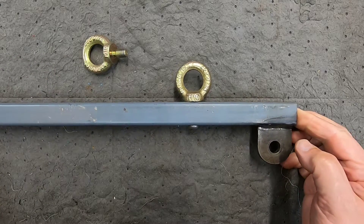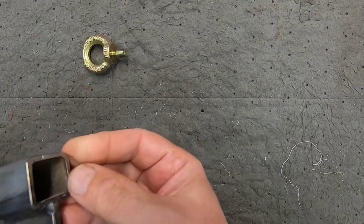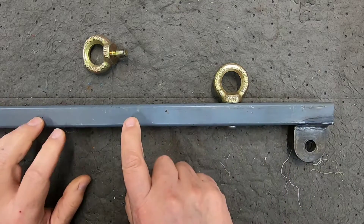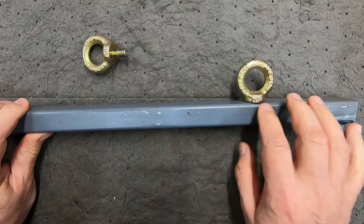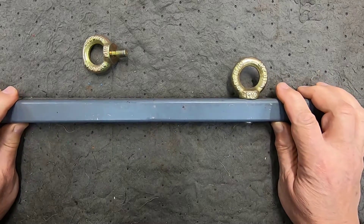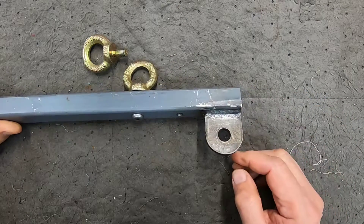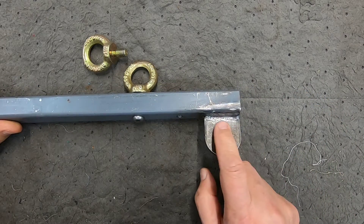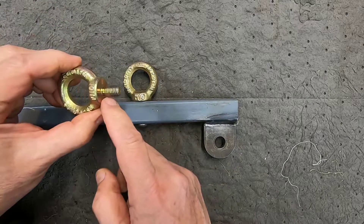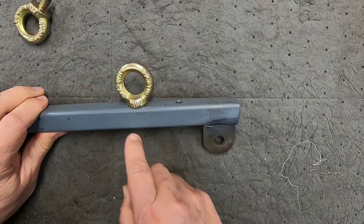So first up, what is it? Well, it's a bit of 25 millimeter square tube, quite thick walled — 2.5 millimeter thick wall tube. Actually, two pieces are joined together; you might be able to see the join. A couple of bits of scrap from when I was doing some practice welding when I first got the MIG welder. Anyway, that's by the by. So it's just a tab welded on and one of these lifting eyes — I just cut the thread off, drilled and tapped it for 8 millimeters so I could easily mount it.